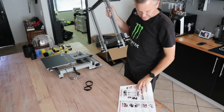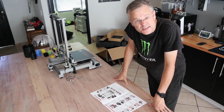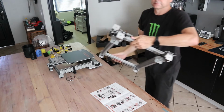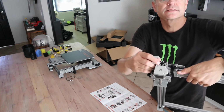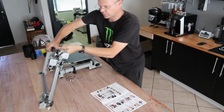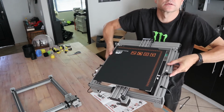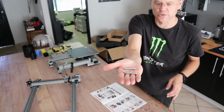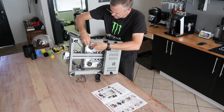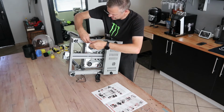The picture over here is the back of the printer. Just keep that in mind when you do the assembly for yours. Still can't figure out how to attach this thing. Oh! There's some screw holes. 2 of them over there, 2 of them over here, and in the base you've got corresponding screw holes on each side. For this operation you're going to need those long screws, and there's a matching Allen key for it. Hopefully you guys can see this. It's just the 2 screws. I have to say, this is quite a sturdy frame. Nice.